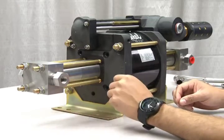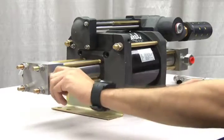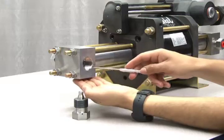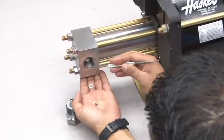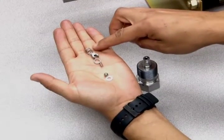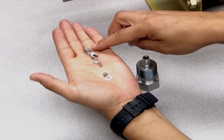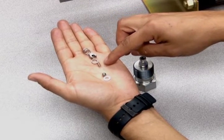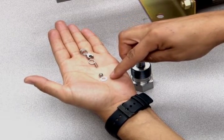Here is one of the hydraulic section inlet check valve assemblies. To disassemble, first unscrew the outer bolt and pull out the internal parts. Use a pick or other long object to get all the parts out. The internal check valve parts include the large spring, cage, ring, inner spring, ball, and Teflon seat.